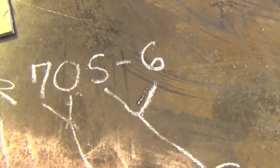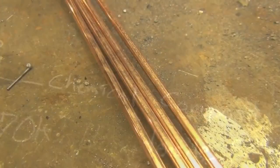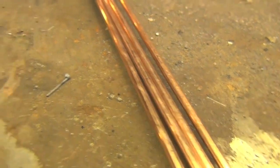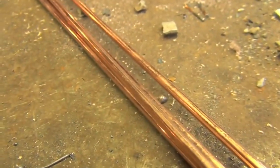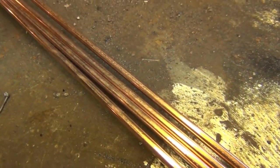The S-6 tells us about the chemical composition of the filler metal. Sometimes when they manufacture this wire they put a little too much oil on it, or there can be a tiny bit of corrosion or contamination. If it's just light surface stuff, you can run the wire through a Scotch-Brite pad like this, which will shine it up and get it perfectly clean.